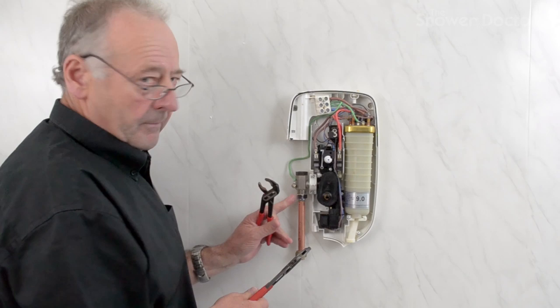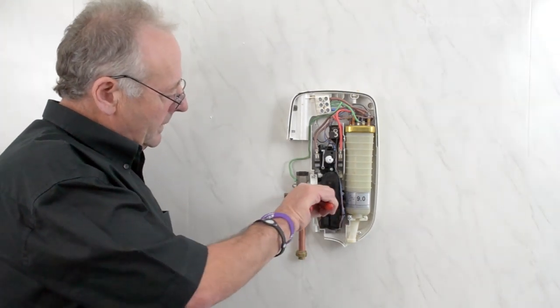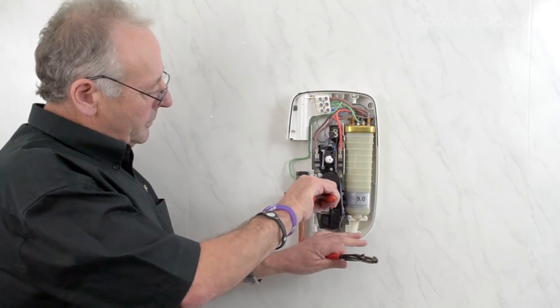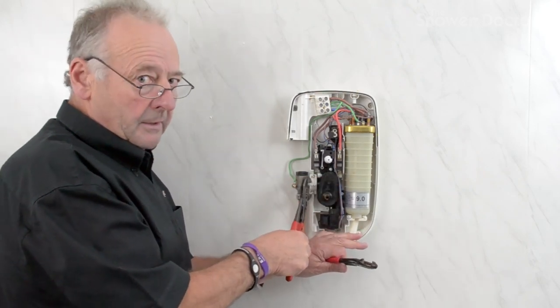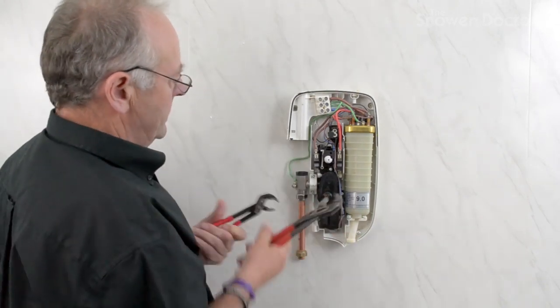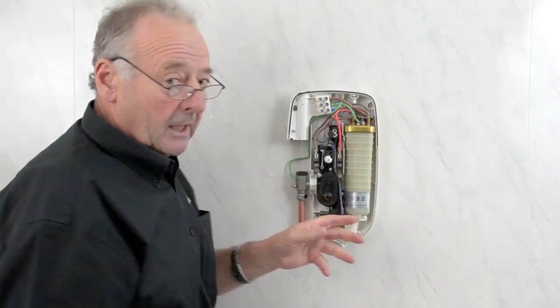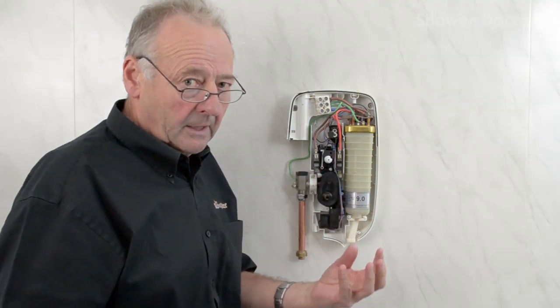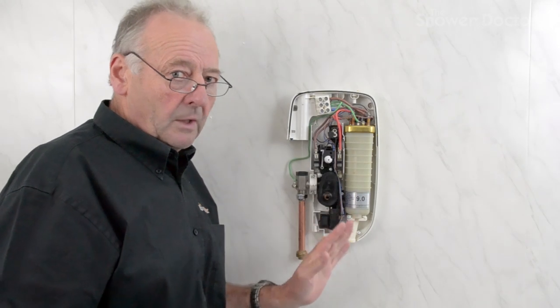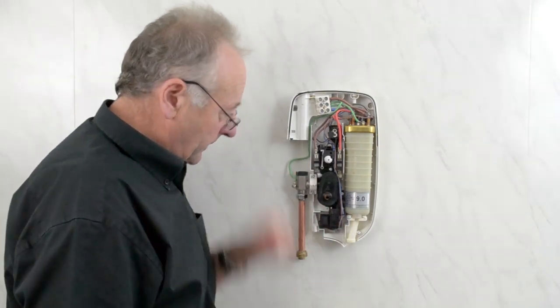Just check that the inlet connector is going absolutely straight. The other reason these split is when a plumber comes and tightens it up — he's put a lot of pressure on the clamp. It may have had a hairline crack in it, but he should have been holding against himself and using two pairs of pliers when he tightened this up. When replacing the clamp, make sure the pipe is square and there's no strain on the new clamp.